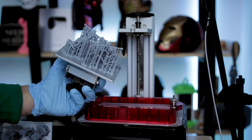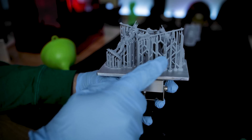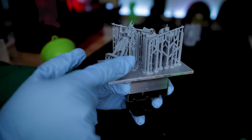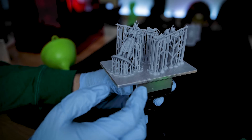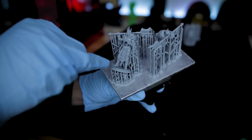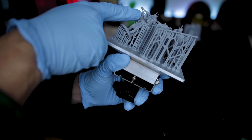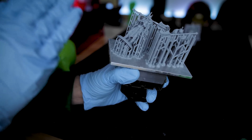Third round of prints — which is the first without print failures — and as expected this printed beautifully, really good looking. Here are the prints all cleaned up and out of the ultrasonic cleaner: mine on this side with auto-loaded supports, and 3D Printing Pro's updated insane support settings, which used almost entirely small and medium supports other than the base and a few strategic areas with heavy supports. Everything looks like it's printed really well. One little area with the loincloth where the support didn't fully adhere, but it printed pretty great regardless. The next step is getting these off and testing support removal — you can already see some are starting to come loose, and just using my finger I can pop those right off. These support settings are really, really nice.